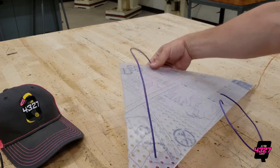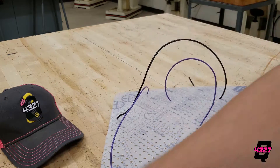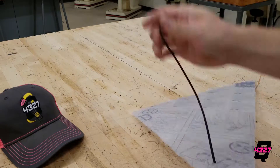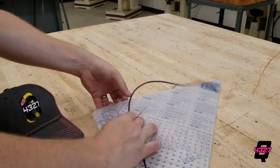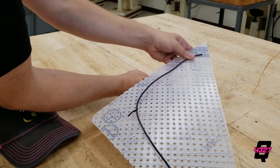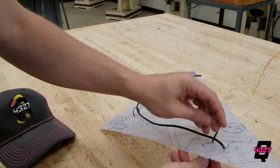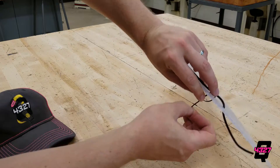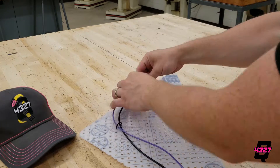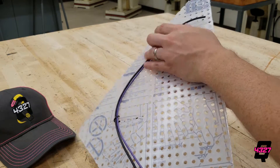Finally, to route the wires. This is for aesthetics but also helps during troubleshooting. When making an electrical system, you will want to follow the concept of making roads and not a bird's nest. Even though the route from point A to point B would be shorter by taking a direct route, your robot will look cleaner and be easier to troubleshoot when stuff does not work by following common routes. Use zip ties to collect wires together and cut to length. Be sure to label each end of the PWM cables when wiring to trace issues during troubleshooting. A cleanly wired robot is something to take pride in and will certainly make a good impression on the judges. Now you know some basics about wiring — go wire your robots, always do your testing with the power off, and be safe. Good luck.